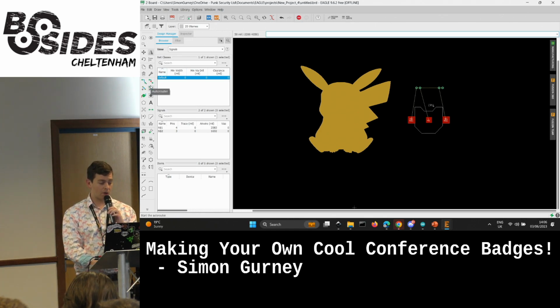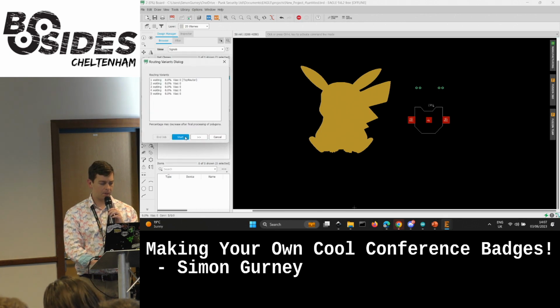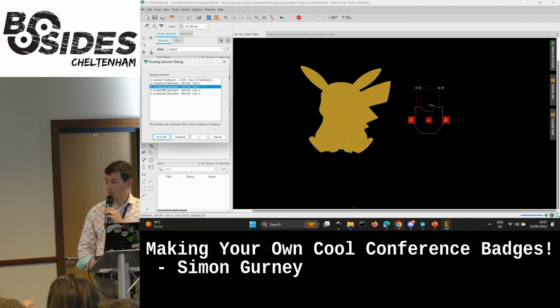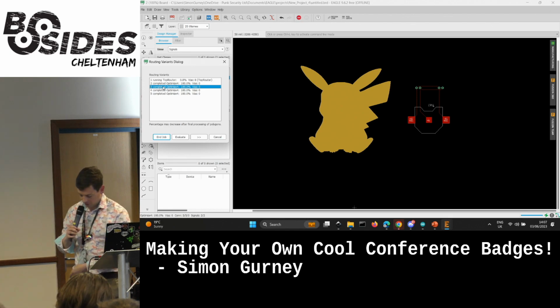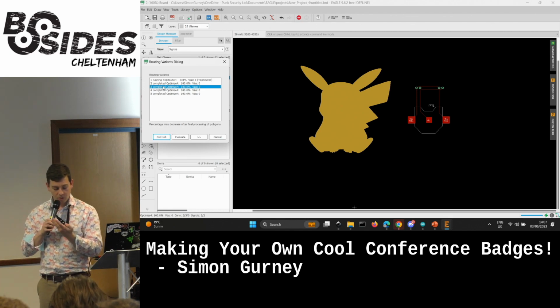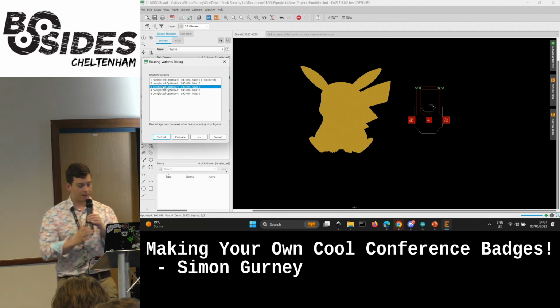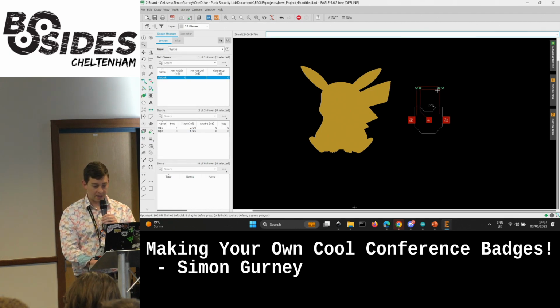And then there's a tool over here called the auto router. So we let that go, and it's going to... All right, did a funky job of that. It's going to design some routes for the wires inside the board. So you'll see this on the back of your badges as well. There's all those wires underneath there, snaking all over the place, linking all the stuff together. That's what this auto router's job is. So you can pick the one that you think looks the most aesthetically pleasing or what have you.